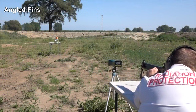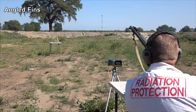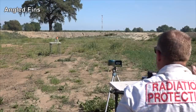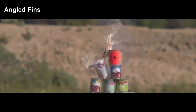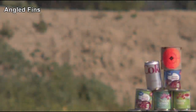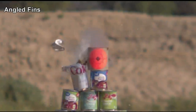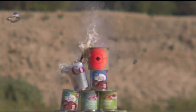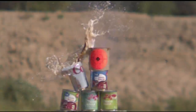In this first test with the angled fins, we can see that they do indeed impart a very significant spin on the projectile — in fact, a greater spin rate than if it were shot out of a rifled barrel. This projectile is flying close to 1,000 miles per hour and you can see shock waves coming off the tail surfaces. Even though it's spinning like a top, it never quite stabilizes. The big surprise is it wasn't terribly inaccurate. Let's give it another try — maybe this was just a fluke or we had poor sabot separation.